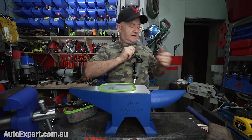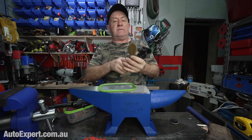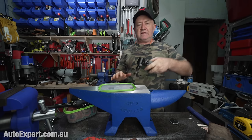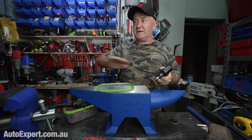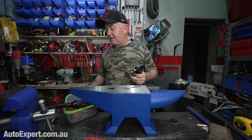We'll just see if we can do this quickly. They just screw on like that and they stay in place. Obviously, wear your safety specs when you do anything like this, and don't stand in the plane of rotation of the disc. Get down here and be above it, so if something goes wrong and it comes off at high speed, you're not in the line of fire. At least the eyes that you can never replace will not be in the line of fire.